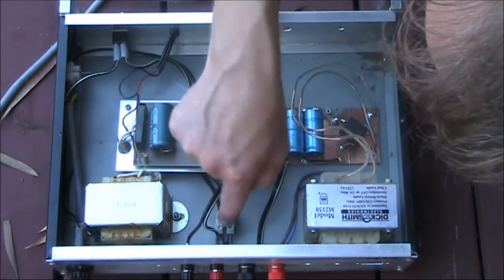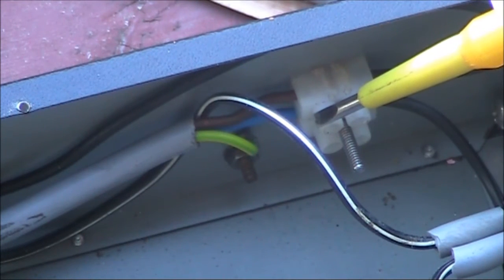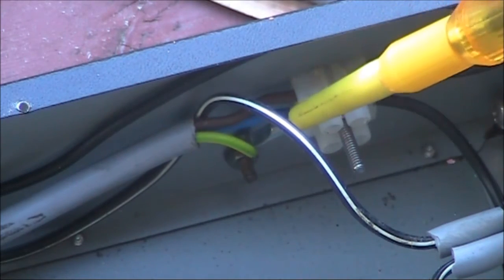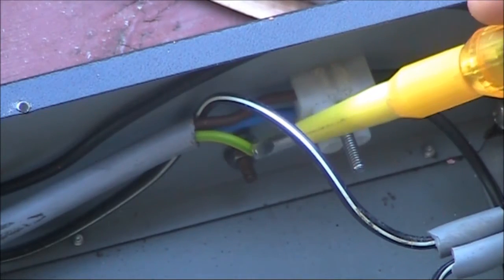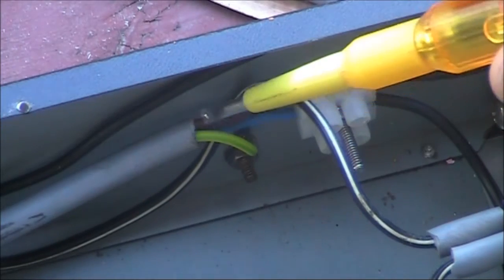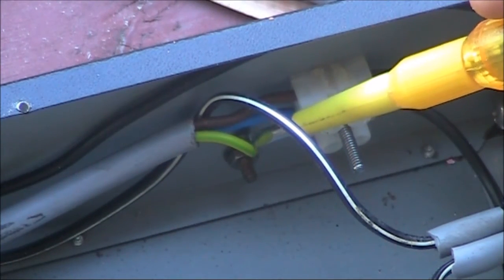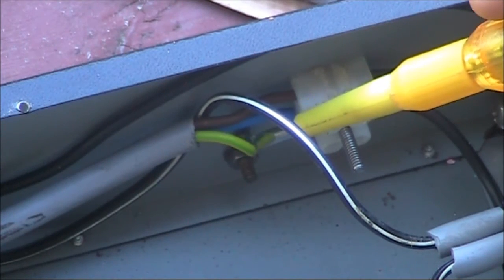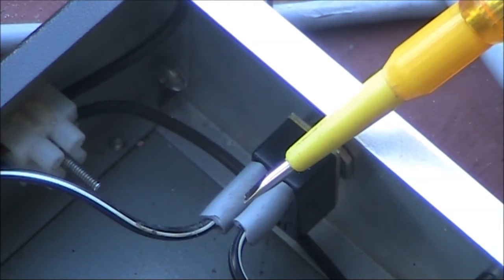All parts of this supply at 240 volt potential are the fuse, the main switch, and the connections to the primaries of both transformers. This is where the mains power cord comes in. One important thing: you need a bit more slack on the earth wire than on the active and neutral wires. The purpose is that even if, despite your best attempts at cord anchorage, the cord was to pull out, the earth wire would be the last to lose contact — assuring a little extra safety.